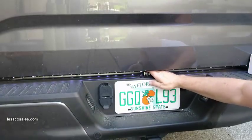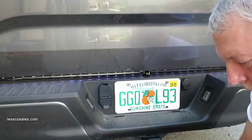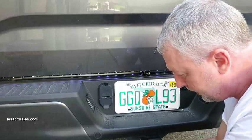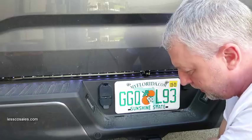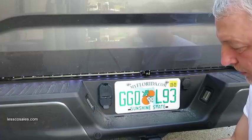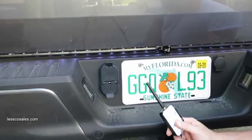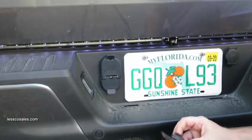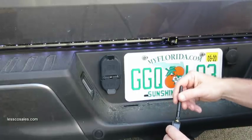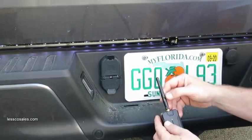My camera is here — I'm just going to leave that loose tentatively. On the other end you have your video and your power, and you're just going to go color to color. Once you've got that, you can have this noise filter here. Then you've got your transmitter which I would zip tie personally — I don't know if I'd rely on tape. 3M tape's good but it's not that good. You can adjust the antennas a little bit to maybe increase performance.